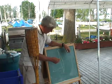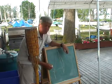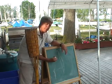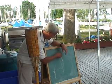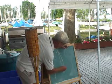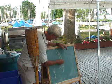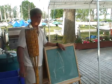When you're using less vang and more mainsheet, so you're sheeting hard, there's less vang here, so you're sheeting more on the leech of the mainsail. This is pulling down hard, so the leech is harder. What happens then is because you're pulling here, the mast bends more up high. You see what I'm saying? If you're sheeting with the vang, because of the forward thrust, the mast bends a lot down low. When you back off the vang a bit and put more sheet tension on, the mast is going to be a little straighter down here and a little more bendy up top, because the sheet loads up the leech, and the leech pulls the head of the mast back.